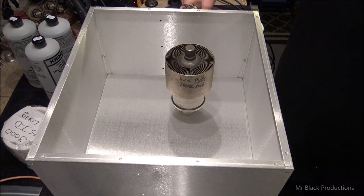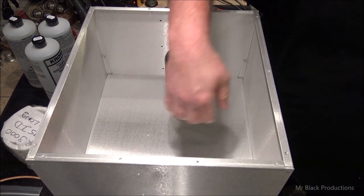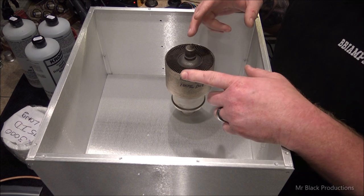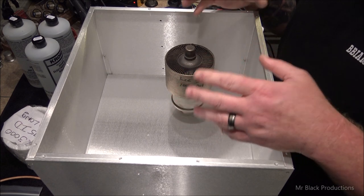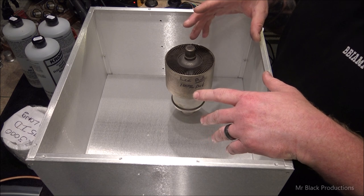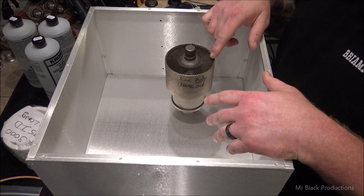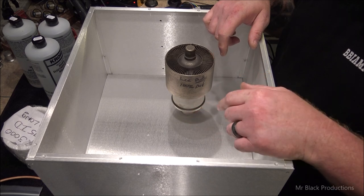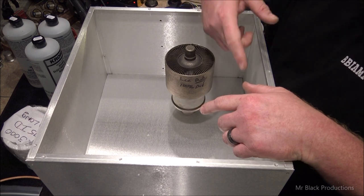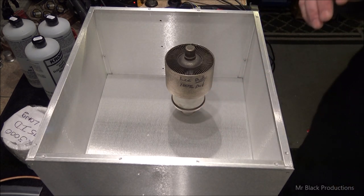The air is going to curl around inside this box and bang into every thing. And as it's doing that, it's causing wake turbulence. The turbulence is good. If I just had a flat pressure behind this tube, you're not going to get the same amount of volume through the base of this tube as even if I had a little fan in here to cause turbulence. That tumbling air is going to allow more volume to move through.